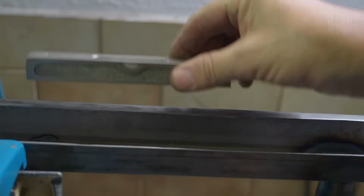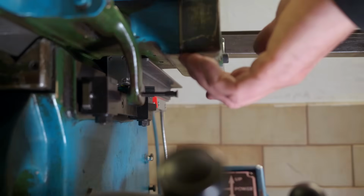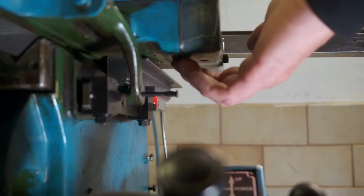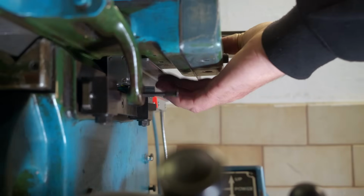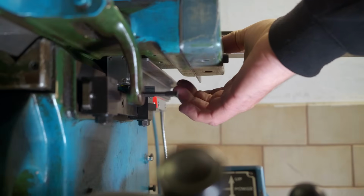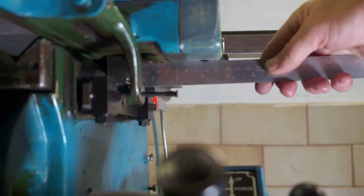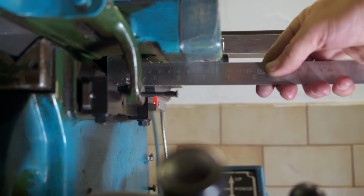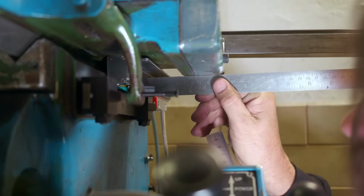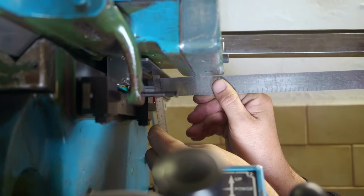Alright, and does the gutter angle down to the drain? Yes, it does. Now I've got one part of my bracket captured here. I've got a second part of the bracket here bolted onto my scale. So now all I got to do is just connect them. I'll put a bolted joint on here. So it looks like it needs to be about 6 centimeters, but it's going to need a joggle in it, which is going to need to be about 5 millimeters up.